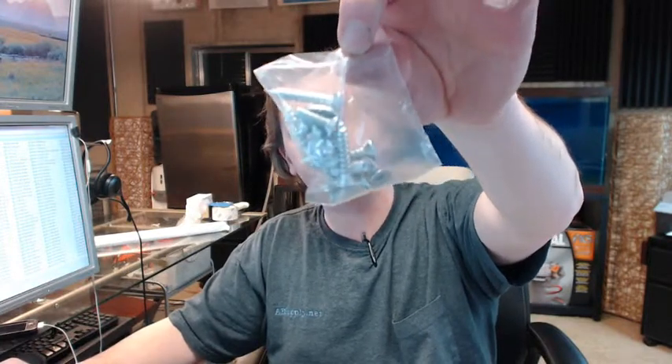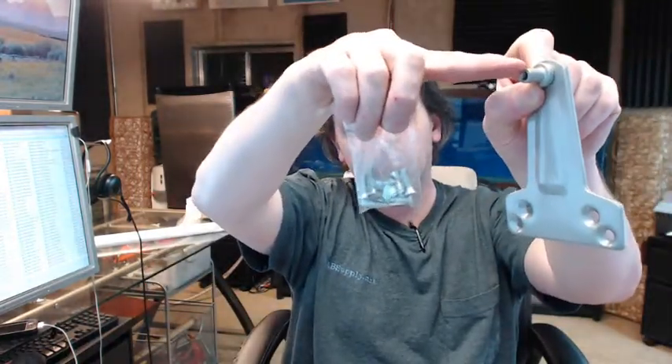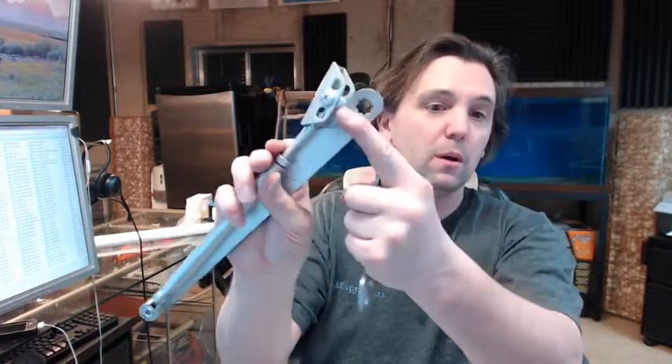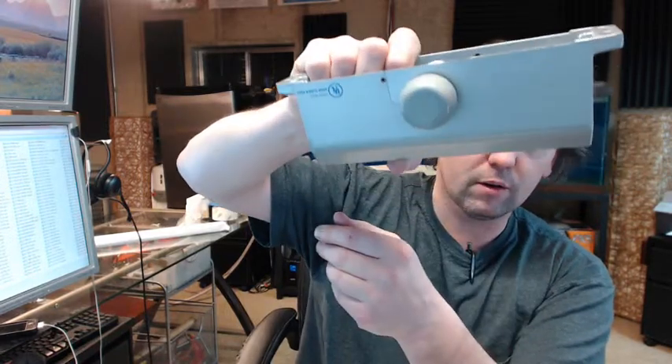The screw pack includes wood screws and metal screws to hold the body, a screw to hold the arm to the closer body, and two screws to hold the arm shoe to the door or frame depending on your installation method. For a parallel arm install, an additional screw pack is included to attach the parallel arm bracket to the header. You remove the shoe via its screw and the bushing mounts directly onto the parallel arm bracket. A cap is also included to dress up the underside of the closer.